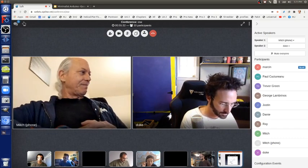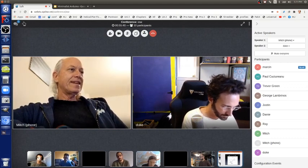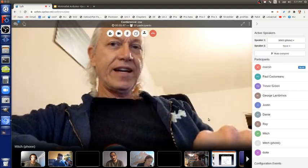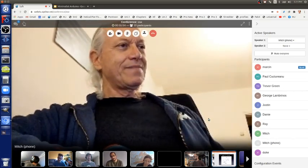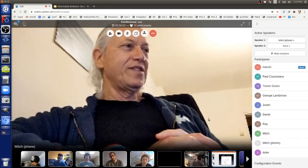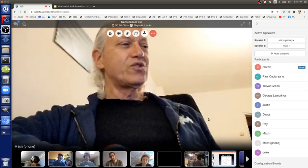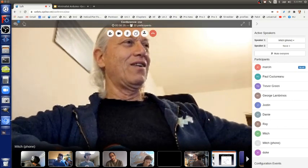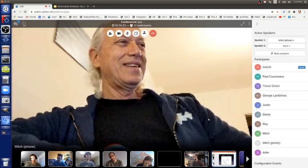This is a relatively small project with not too many parts. If you have something complicated, it's nice to have, in addition to the 100 microfarad and the 0.1 microfarad, 0.1 microfarads interspersed between power and ground all over the board. And that shorts out places on the board where noise might get into the circuit where you don't want it. Because digital is only digital if there's no noise, and the capacitors help you keep the digital as digital and not looking like analog. If noise gets on a digital line, it starts looking more like analog, which messes things up. You want only high or low,